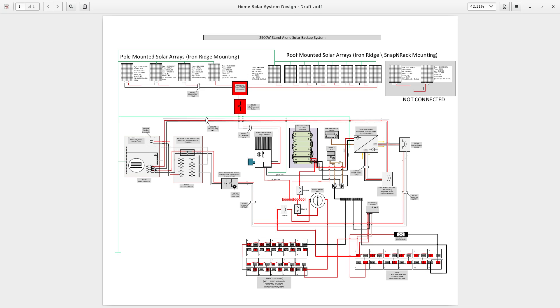This circuit breaker provides power to the inverter to charge the batteries. The bottom circuit is in place for when I'm on grid power or need to do maintenance on my system. I flip the switch to utility so that utility power from this circuit breaker feeds into the main panel and energizes those two branches normally — connected to the grid — while I work on my system.